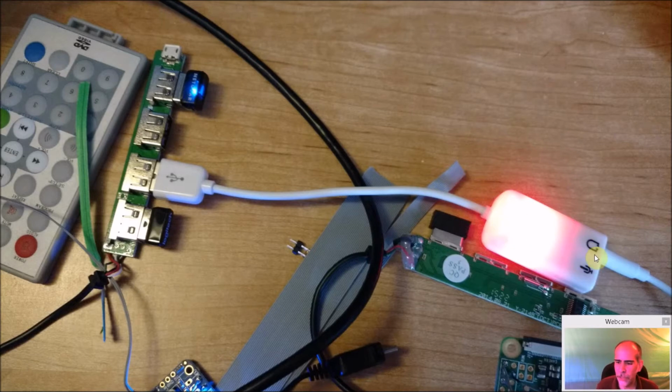The headphone jack is here. There is a microphone jack. I actually just snip off the end. So when it goes in the unit, the headphone jack can go out, but the microphone jack is flush. It just helps to make a good seal when you put it in. And you can see here, I put some hot glue here because one actually popped off just in moving it around. So I resoldered it back on and put some glue for strain relief on there.